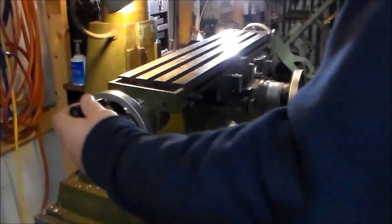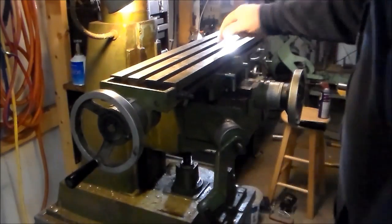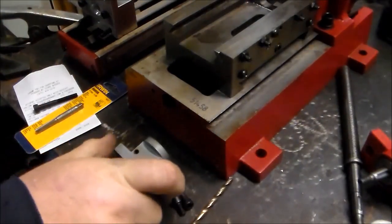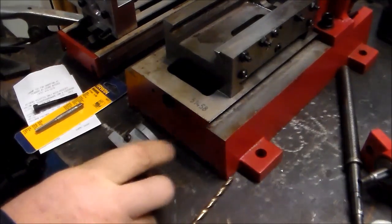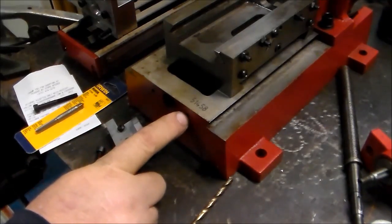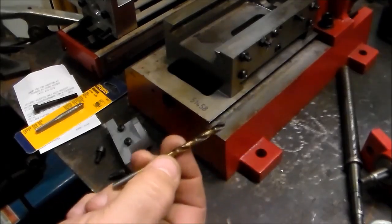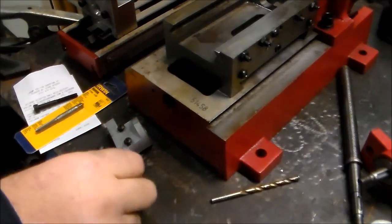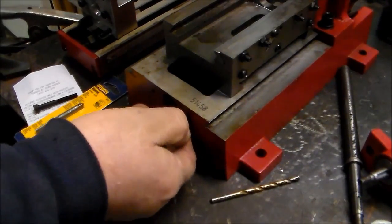After it's all put back together, this is amazing — this thing's silky smooth, no backlash. It's got backlash-adjustable lead screw nuts in it, and I'm like, wow, why did I put this off so long? This original Y-axis bearing block was held on with these two little Allen screws. I looked at what some guys had done and somebody said they drilled the original holes out and retapped them to quarter-20. Well, I grabbed the drill bit for a quarter-20 tap and punched this hole out — it barely even took any metal out and the screw still threads in there just fine.